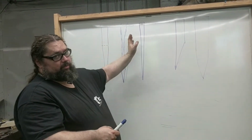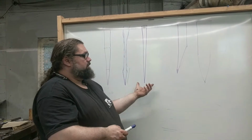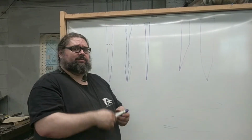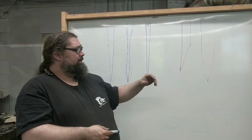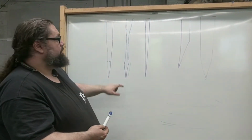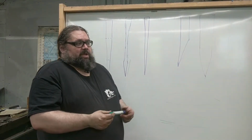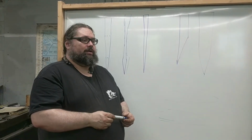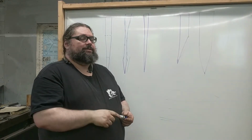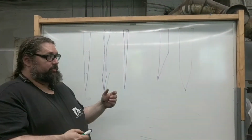This is just a very thin, full height flat grind, sometimes to zero, sometimes to almost zero. These tend to cut really, really well in things that aren't sticky. Vegetables, if you're doing lettuces or things like that, these tend to cut in just all day long. For a universal knife like a chef's knife though, I think one of these two grinds is the way to go. I've done some S grinds and I've played with them and I've used them in my kitchen, and I didn't see a whole heck of a lot of difference. Basically now I only use an S grind because I can charge an extra $150 or $200 for it. So it can be worth it for that reason. But you do need a special platen to be able to do that.